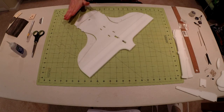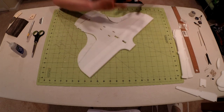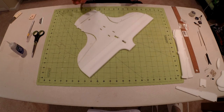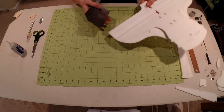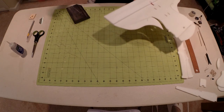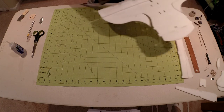Since our main wing assembly is now complete, we're going to take our sanding block and round off the leading edges of the main wing. That will actually help to alleviate a little bit of the pitchy tendency that blunt leading edge airframes have. So we use our drywall sanding block, or you can use your sandpaper on a stick, or hand sand it, whatever you're most comfortable with. But it doesn't take much.